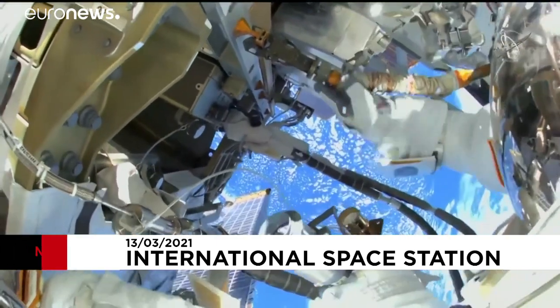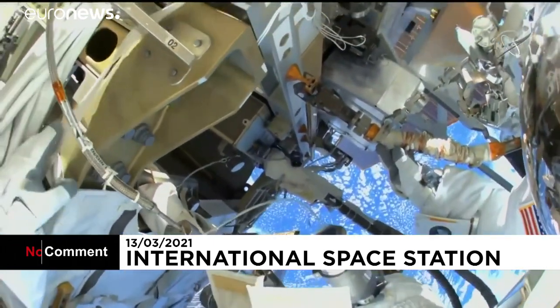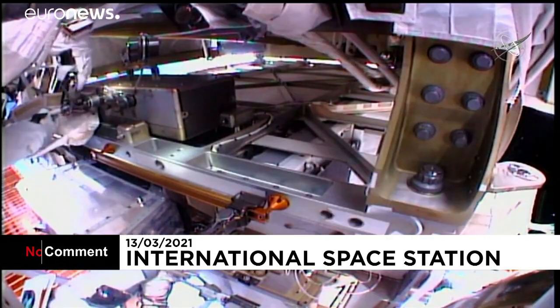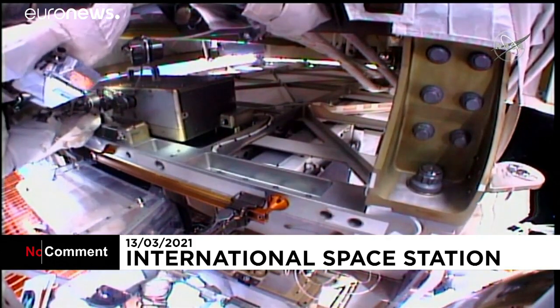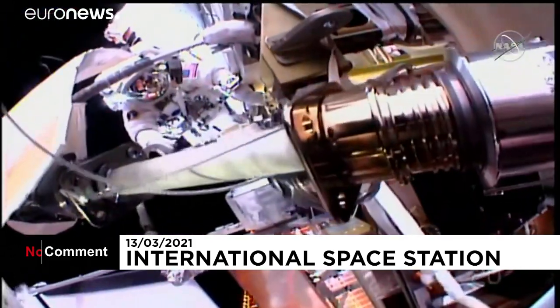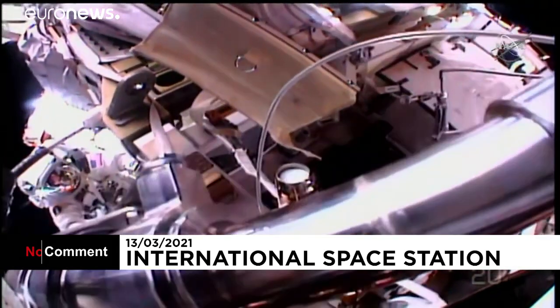Okay, let's go ahead and mate that hopper so you can mate the QD extender to the vent tool adapter. Okay, that's a good config. The QD is closed as expected, so verify that it's ready to mate. Check that the detent button is up and the forward white band not visible.